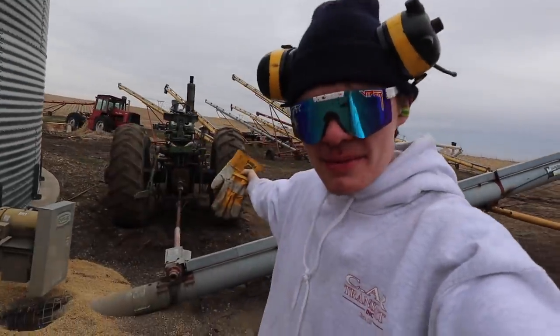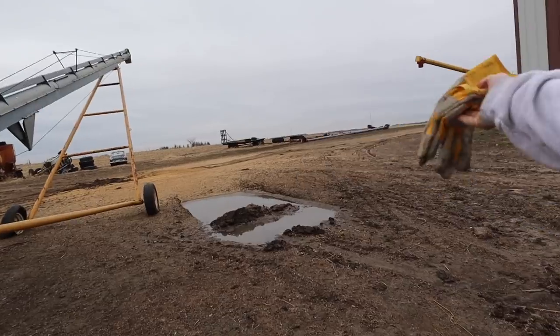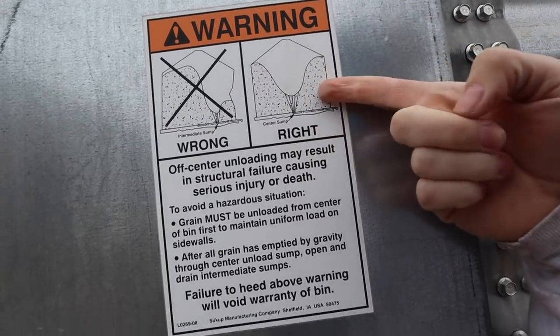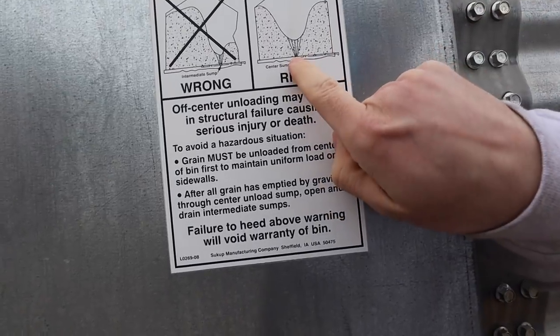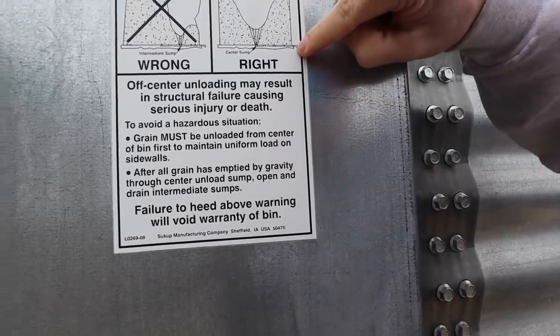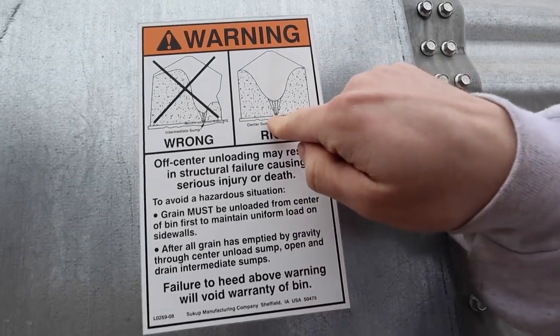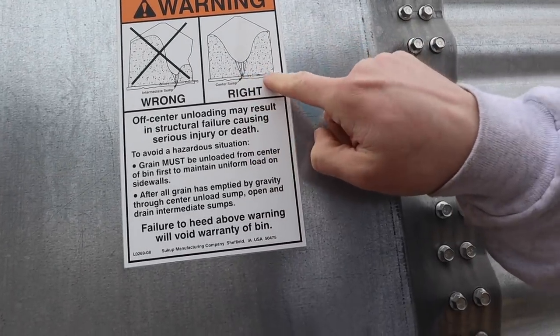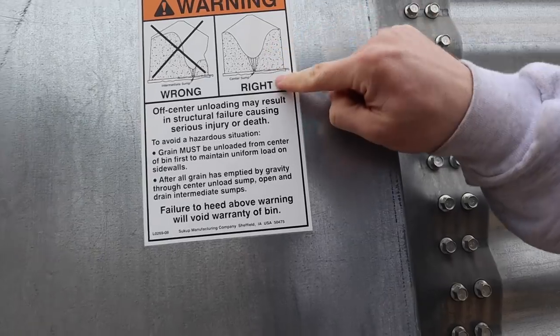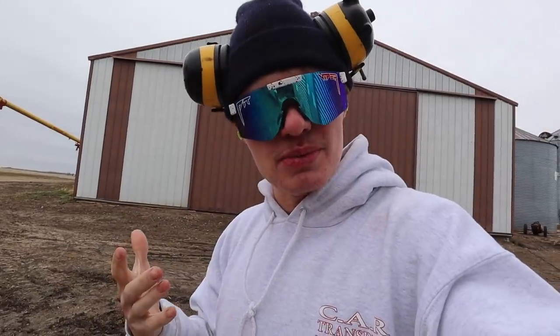In the past few days I've done this so many times, hardly even took me 30 seconds. So this is a rough sketch of what it looks like inside the bin. I just have the center sump open and it takes it out to this auger. The bin's starting to get empty enough where beans are no longer running out of the center, so I had to open the side holes. Once those side holes stop running out, we gotta turn the sweep on — I'll just show you when we get to it.